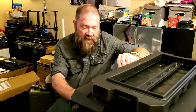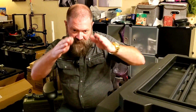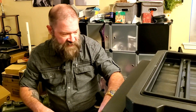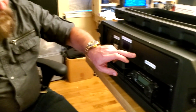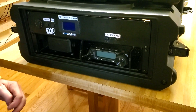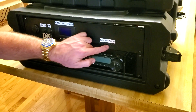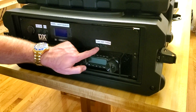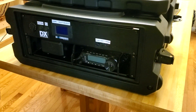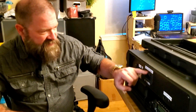Make sure everything's grounded properly. The FT-891 comes with a little tiny mounting bracket — that's actually screwed down to the bottom shelf I purchased for this case, and the speaker is also screwed in. The battery on the back has no mounting provision so it's zip-tied in with high-strength zip ties. Same with the tuner — I just drilled a couple of holes to expose the SWR LED, tuning LED, and tune button. Once you key up on the radio, it goes into action and starts matching resonance for your antennas. I used step bits to drill the round holes and Dremel blades for the rectangular cutout.